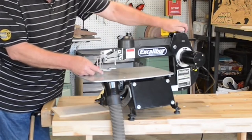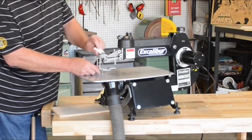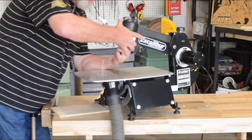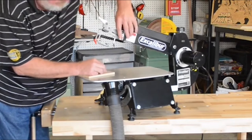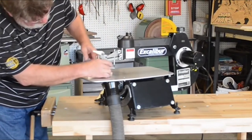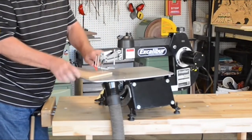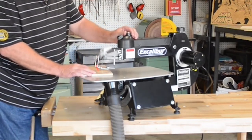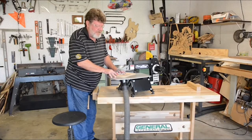For blade tension, you go to the knob on the rear and that sets it. To change the blade, release the cam tension and the thumb screw. With this machine, for internal work and threading, it's very nice — I can lift the head out of the way, drop down into my workpiece, bring the head back down, thread my blade, tighten the thumb screw, and get back to it. The variable speed feature lets me slowly increase the strokes per minute until I'm getting an optimal finish and an optimal cut.